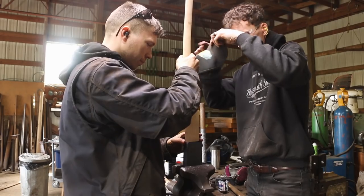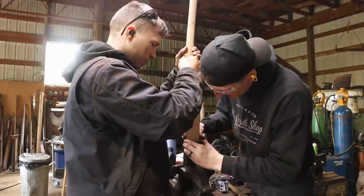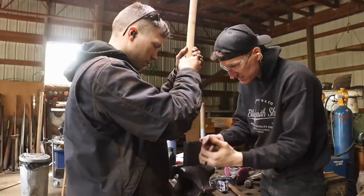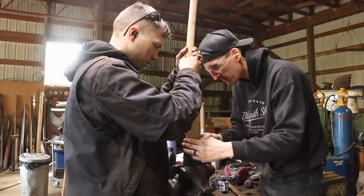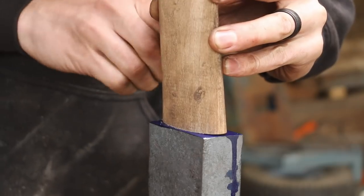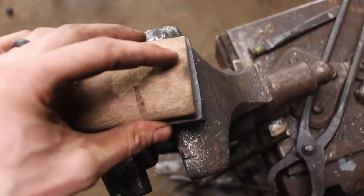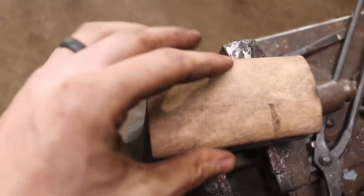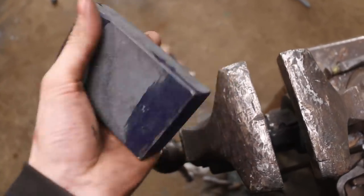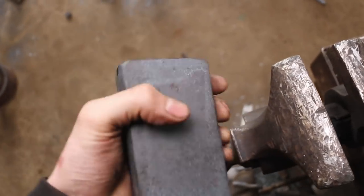What I'm doing here is using the handle to trace the oval. I just have Martin help me out holding it. I'm going to use a scribe to trace it. I'm going to do the other side with the fat end, and then I have both ends for grinding. There you can see the scribe line. So essentially I've put the small end on this side, the big end on this side, so that when I grind it I can just match up both sides. Then we're going to be good to go — just a couple hours of grind time.